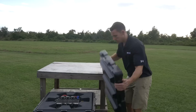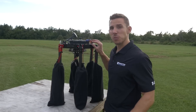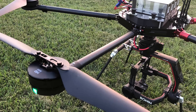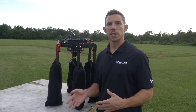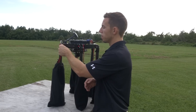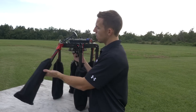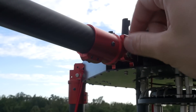Let's put the aircraft together. Here we have it, the MFD 5000. This is really simple, super simple to operate. It's a hexacopter specifically designed for the DJI E5000 Pro motors and ESC propeller combination — it's been running really great. Assembly couldn't be easier. Each of the arms simply collapses. The first thing we do is just remove the thumb screw, which is in there for safety and safekeeping — it's a quick release latch. Take one of the arms, fold it out, and it pops right into place. Then put the thumb screw back in and tighten that down.